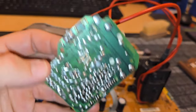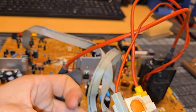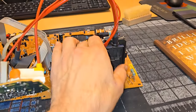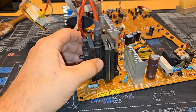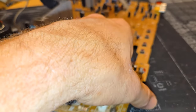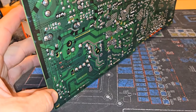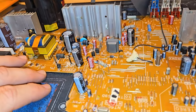You can see the shine off the fresh solder points right there on that board. And to clean this side, no. I don't think I would be able to really get this 100% clean of all cigarette soot unless I did something like an ultrasonic clean, and I just don't have that size of equipment here. But the new caps are all in here.